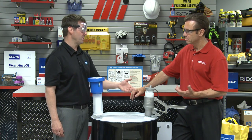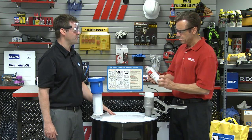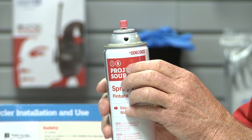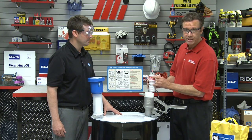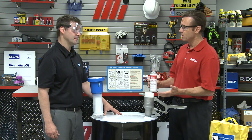When you're done, you can remove the can. Then all you need to do is throw it in with your standard waste stream or any recycling program you may have. You can see the puncture right there on the can — and like he said, there are no sharp or jagged edges. Depending on how many you use, that could really add up. Once you puncture the cans with the unit, you no longer have to deal with them as hazardous waste, eliminating that expense.